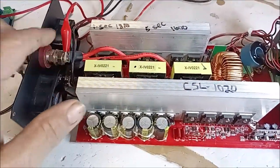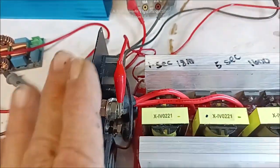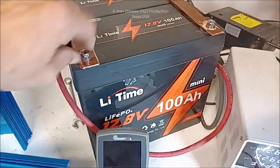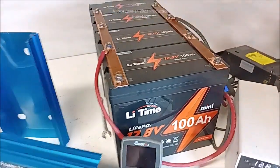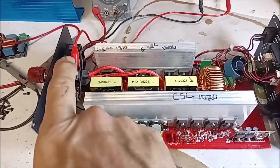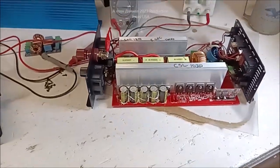He was telling me he hooks up a load and the voltage drops. I said go in here and check — make sure those lugs are tight, because this right here requires 25 inch-pounds of torque or you ain't going to get full power. Minimum 25 to 30 inch-pounds. Most people put them on with a screwdriver and wonder why their trolling motor doesn't work. DC power requires torque. So if your inverter isn't putting out good full power and you've got the right cables, check those lugs. Turn it off, disconnect it, flip the power switch a few times to dump the capacitors so you don't get a big shock.